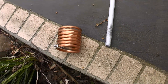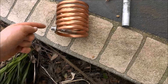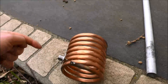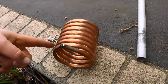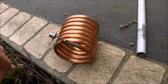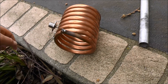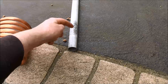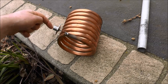I'm going to put this down the bottom in an enclosure. It's going to be vertical, obviously, and I'm going to put a coax in here — only the core goes to the element, and the braid of the coax goes down to the ground, or I'll put some counterpoises up. Then I'll come off the bottom of the vertical element to one of the taps, and we'll see which one is better.